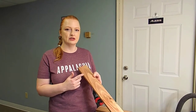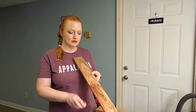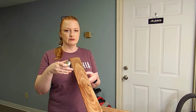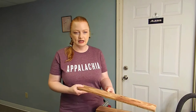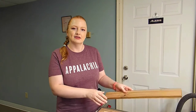For the next part of our project, we are going to rip down the edges of these boards on the table saw. Now with pallet wood, you never know what you're going to get, and we'd really love for this to be three inches in width — it would leave a lot of room on each side of the candle, make it nice and even. This is really close, like three and a sixteenth, so we're going to do the best we can — it might be a little less than three inches, that's okay. They are going to be alternating in a pattern of maple, walnut, maple, walnut. We've got an extra board of walnut just to see which one we like the best. We really want the contrast of light to dark.